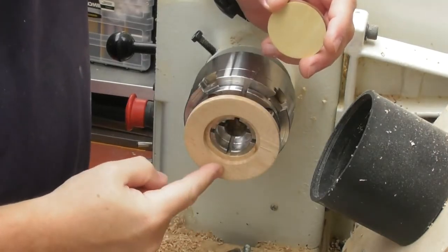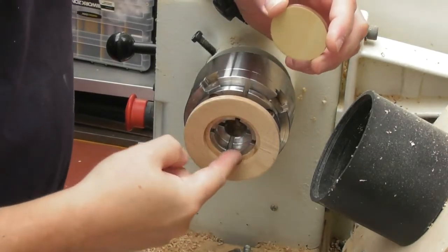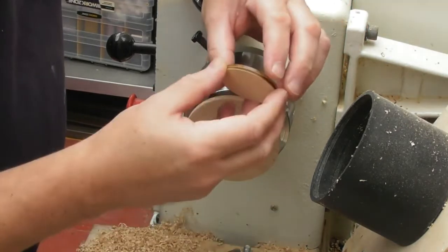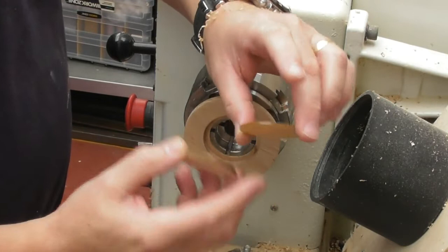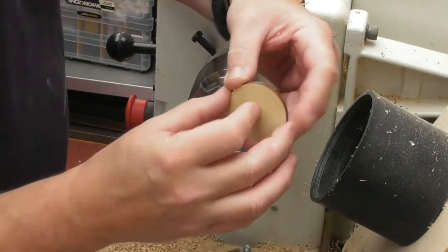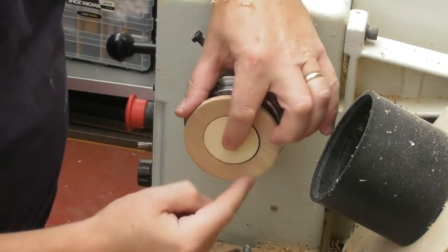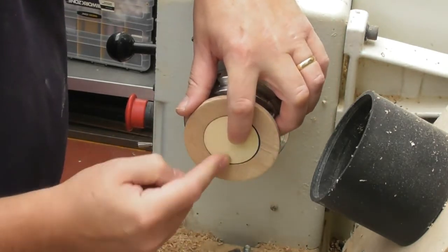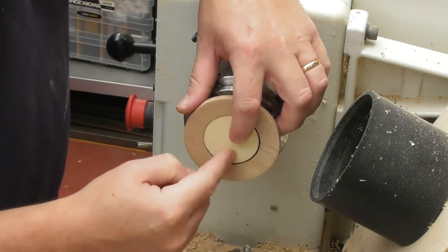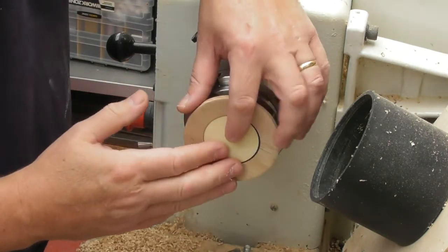We're now looking at the back of the frame, and I've trimmed out the centre section again, so when I put the clear face, it's got a cover on it at the moment, the clear face and the back in there, they should be slightly inset from the frame, and the reason for that is because you're going to put a photograph or some kind of picture in there, which is going to make it stand proud.